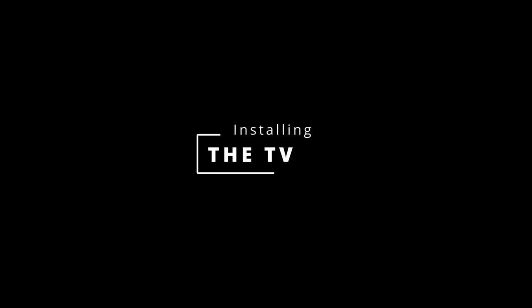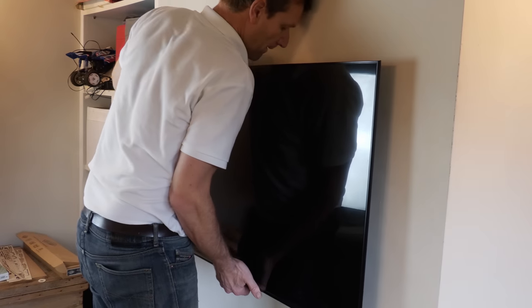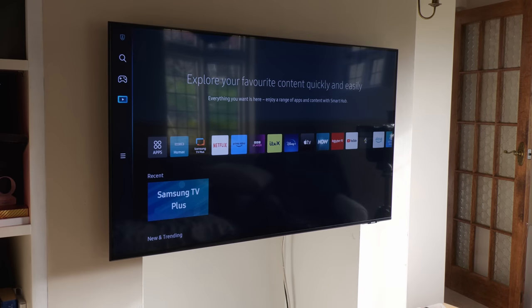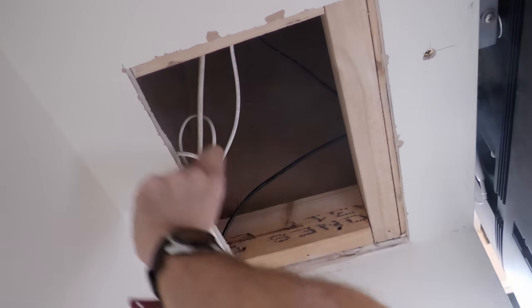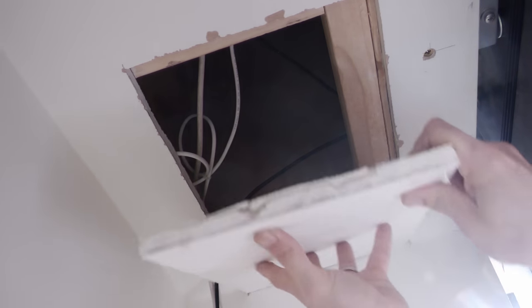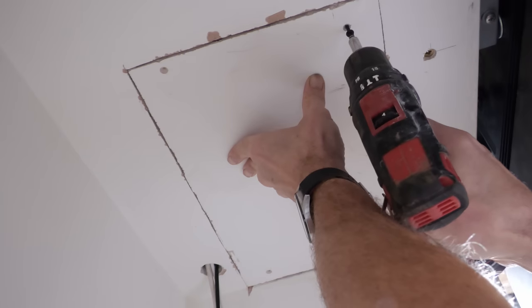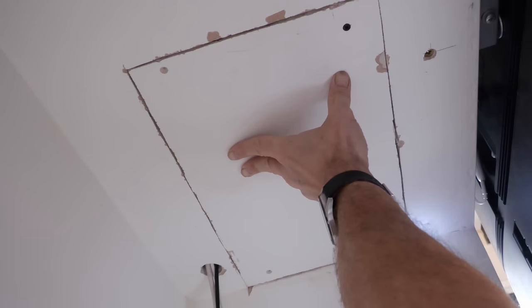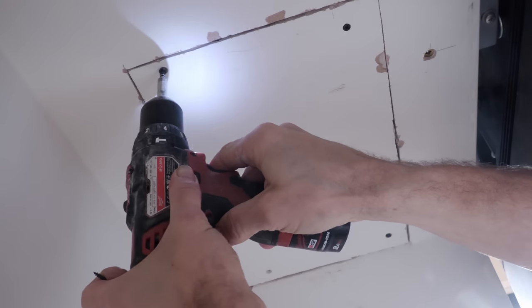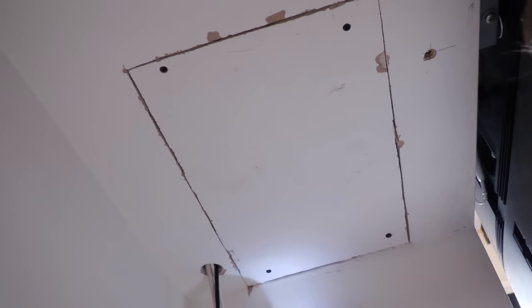So I was pretty much done — all that remained was to connect the HDMI, ethernet, and power leads to the back of the TV, thread the cabling into the newly drilled hole, and hang the TV on the wall. I quite like this bracket — it obviously doesn't swing but I've built in a slight downward tilt with those spacers and longer bolts, and you can also adjust the level with the two fixing screws on the top. With the cabling connected, the TV setup was pretty straightforward. For the inspection panel I put a little nog in to support that section, but I'm going to be taking it out reasonably regularly, and the whole chimney breast is going early next year anyway — so for the time being, a few drywall screws will do. Such a pain they make these with Phillips head — it makes so much more sense if they were Pozi Drive like everything else. Pre-drill because the plasterboard is a bit brittle near the edge, and that's it all done.